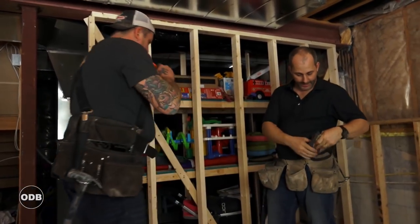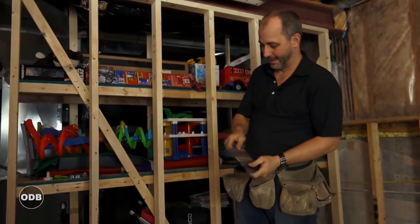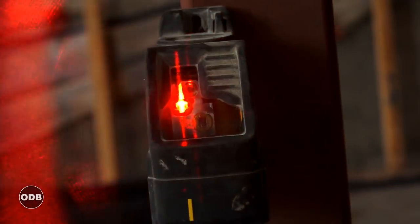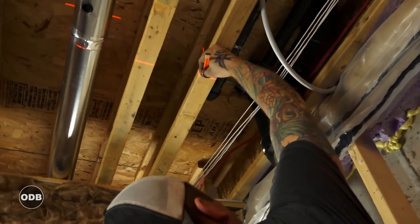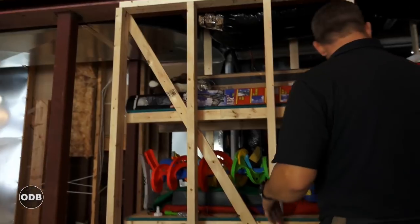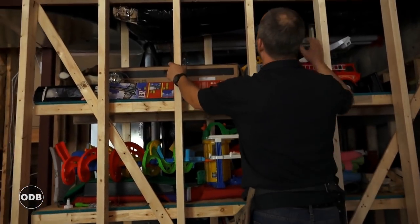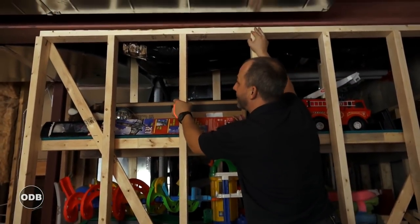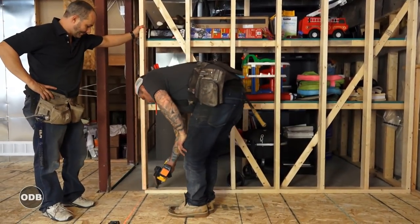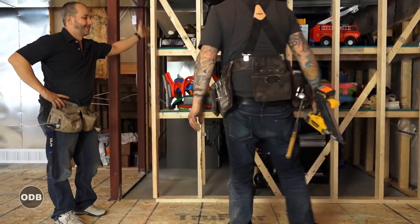Now the way we're going to operate this for leveling is really simple. We're using a laser level system — he sets up a level line top and bottom and you just can't screw up. All we've got to do is know our top plate is going to go level off where the laser line is hitting. And we've got a wall.